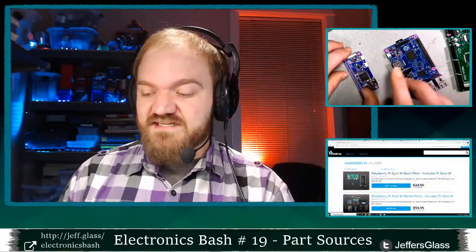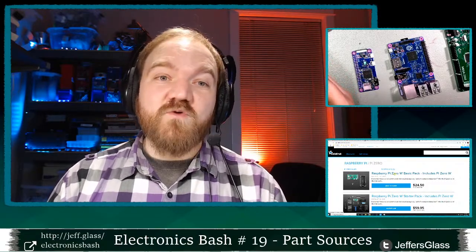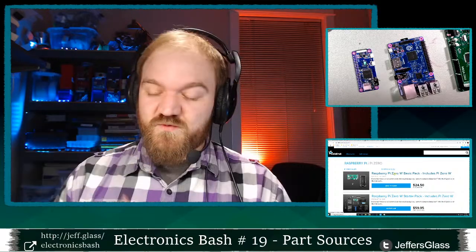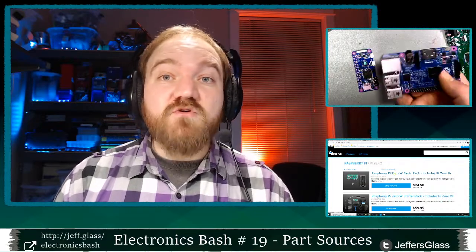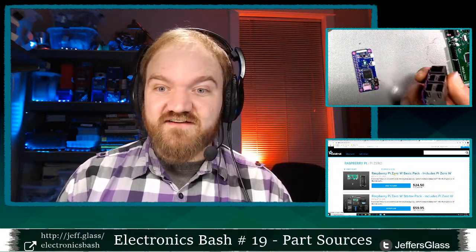And then we'll move on to a few things, where we started with all the Arduino stuff, like blink an LED, read from a switch, that kind of basic functionality. Through that, we'll build some functionality around learning to use CircuitPython to build that code. And we'll very quickly, I think, get into some new stuff that we couldn't really do in the context of Arduino, like an easy way for the user to type in the brightness of an LED and set it to that brightness. Or when the user enters input, play some sound. Or download a file from the internet, and if certain conditions are met, turn an LED on, that kind of stuff.